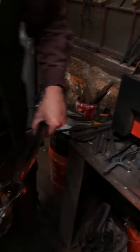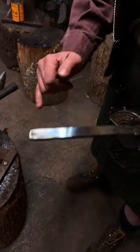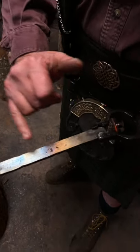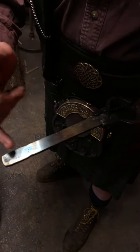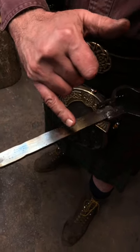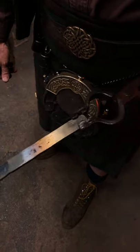Yeah. I think that might be about as good as I'll get. It's not as pretty as I was hoping for. It looks like I got a little bit of a grease stain there, which deformed my blues. But I do have light blue gray over here and kind of a purplish here. It's a little ambiguous in this zone, and then I've got some bronzes and then into the light straw up into that area.